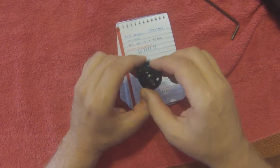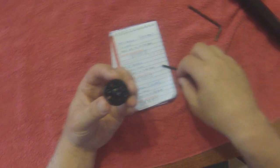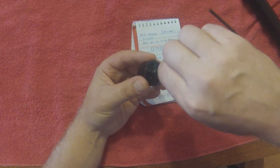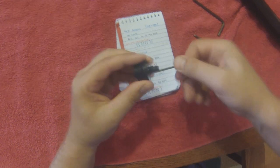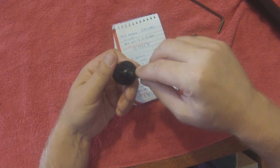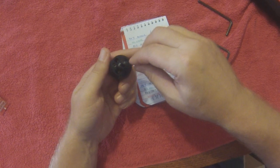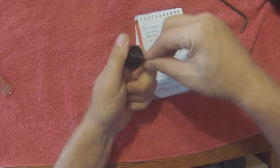Take your cap, line up the holes, and snug everything back down. There's a gap there and you don't want that gap — you're going to cinch these up as tight as you can, because you need to put tension on those springs. Cinch these up tight. Don't strip the screws or anything, but I can always tighten it up a little bit more once I've got it back on the gun.